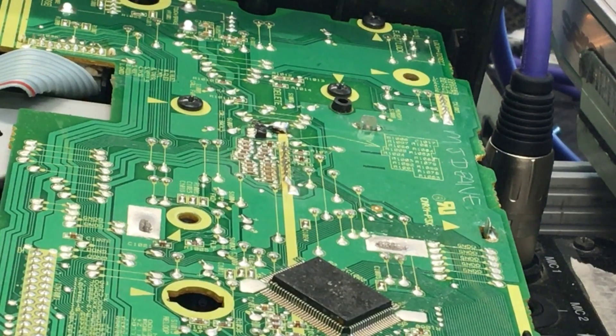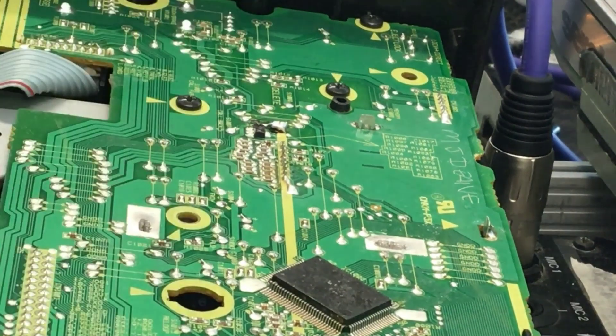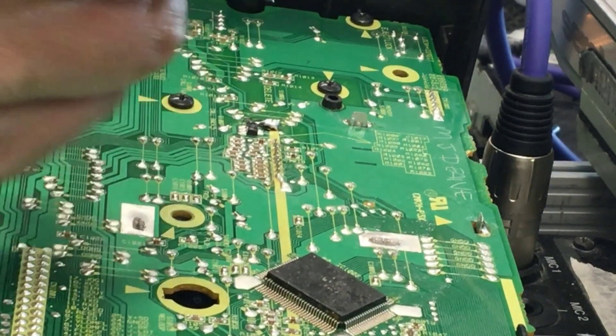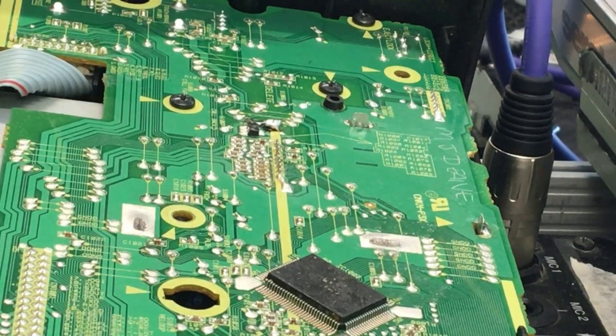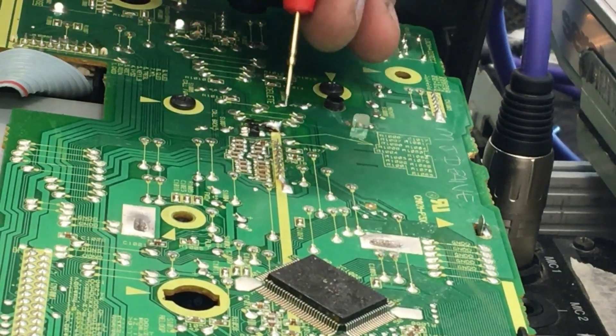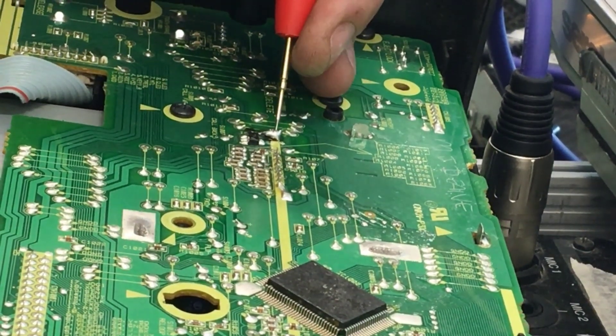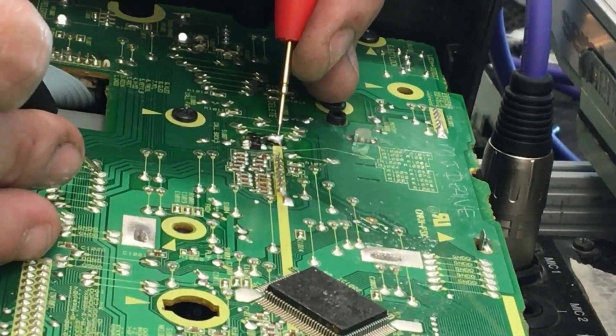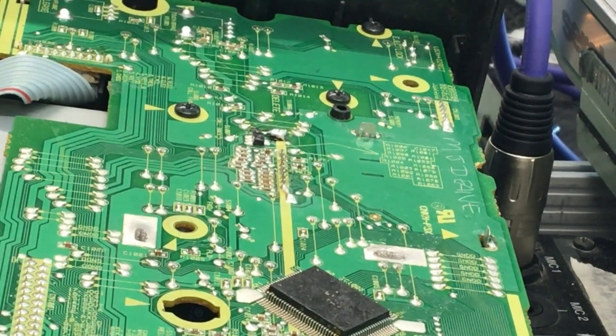Hi all. I managed to bridge the break in the track. Just cleaned the trace off. So I've got my meter set for continuity. When it beeps, it's detecting a signal path. If I come in here, it should be connected now to that one. And it is — it wasn't before.